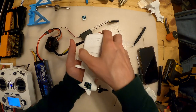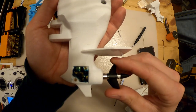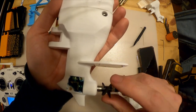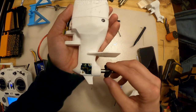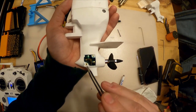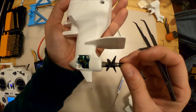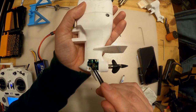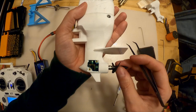So I went back off camera and added some more grease into this thing. But we just want to check out the gear teeth. Everything looks perfect. It's very similar to a real outboard, right? If you see metal shavings or flakes inside of this area, that's a big indicator that we got a problem. Another thing is any weird wearing on the teeth. It's hard to describe, but the teeth shouldn't look like they've got an impression on any particular tooth. They should all look very uniform in color, and shouldn't have burrs or look like they've been stretched or pushed on. What I mean is you'll see a tooth that doesn't quite look like a tooth, like somebody hit it with a punch. It'll be deformed, and I don't see any of that here.